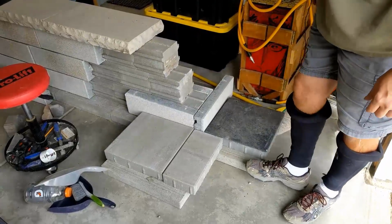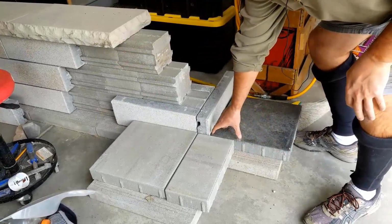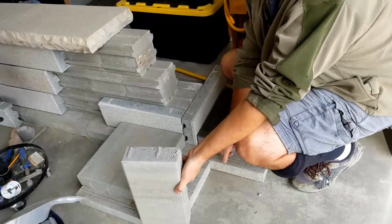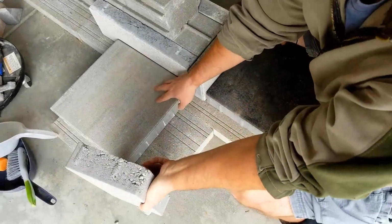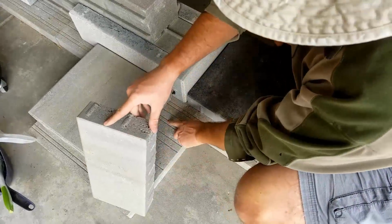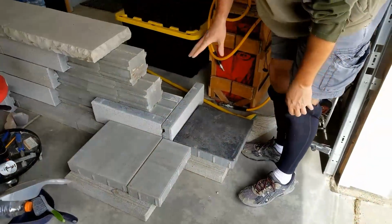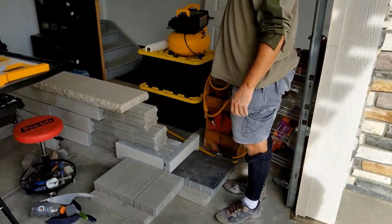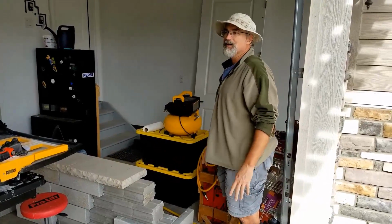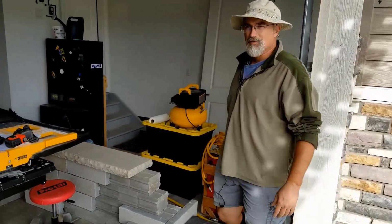In fact, we're going to have this universal base plate go underneath the last one just a little bit, not this far, but probably just about 4 to 6 inches to support it. And also the universal base plate will come out a little bit. So these pavers that are going to be the ones next to the edge are going to rest on it just a little bit, like that. But then underneath here will, of course, be the dirt and the sand. So you can see we're going to have to go dig up a little bit. And so we'll have all that set up. And we'll put these down, but we're not going to put the wall up right now. We'll put these down, get all the pavers in, and then do everything that needs to be done with the pavers. Then we'll come back later and do the wall. So, fun wall stuff.